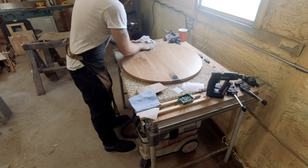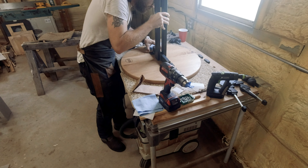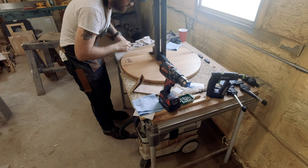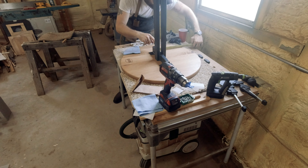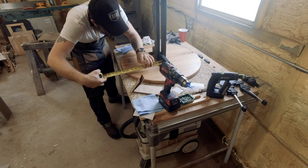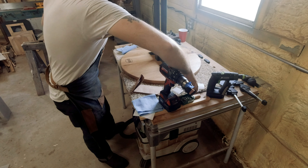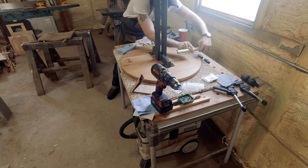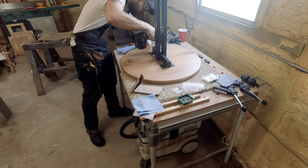I'm using a brown paper bag to basically burnish the top and the bottom of the tabletops - I got that tip from another video I saw and it actually worked really well. It's almost just like a polishing, a buffing 2000 grit kind of sandpaper that's very soft so it doesn't scratch the polyurethane, but it took down any high spots that were there. Now I'm just lining up the base, measuring a thousand times before I drill these holes to mount the screws, and I'll repeat this process seven times until it's all completely done.